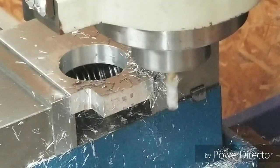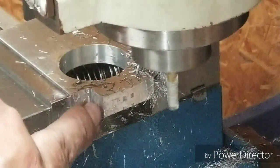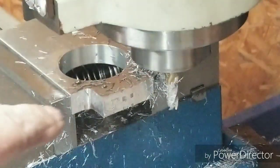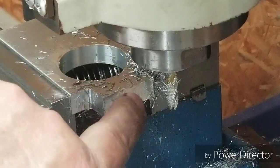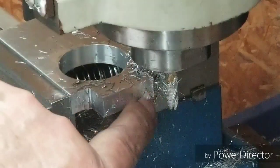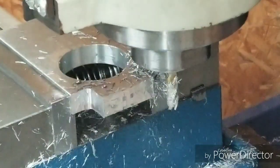We've got them finished. Now what we're going to do — we'll take you over to the drill press and drill a hole through right here, through to the other side. We'll slit it in two. This side will be threaded and this side will just have a socket head cap screw in it.